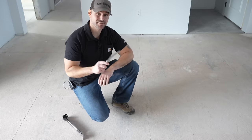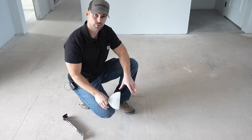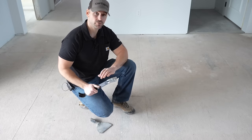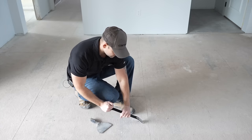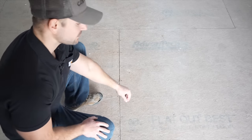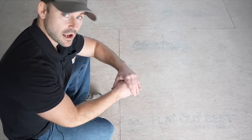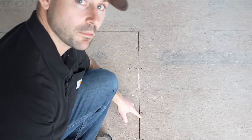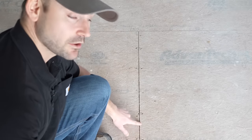A critical part of installing hardwood floor is making sure your subfloor is nice and clean. Go through with a putty knife and scrape off any drywall mud or glue. If something really tough won't come up with the putty knife, take the back end of a wonder bar to scrape it right off. A very common problem with subfloor is wherever joints meet, boards can be raised up from moisture. Use a belt sander to smooth down any raised edges. After scraping, go over the floor one final time with a shop vac.